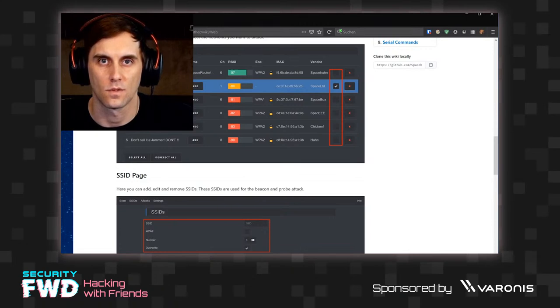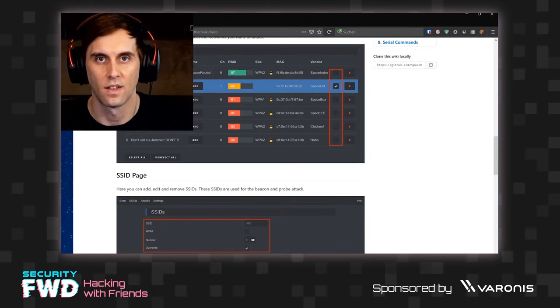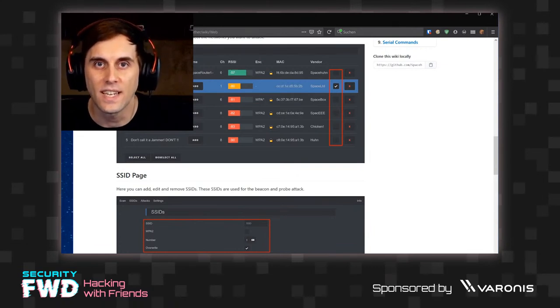Because you are scanning, you can't serve this. You can't keep up the access point and serve this web interface at the same time. The chip only has this one Wi-Fi antenna, this one interface, right? So it has to close the access point, scan, open it up again, at which point you have to manually reconnect, go to the same page, and it's just super annoying. And it has a lot of problems.